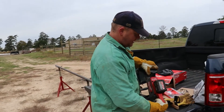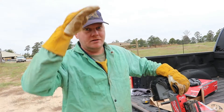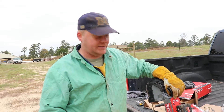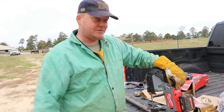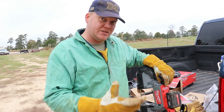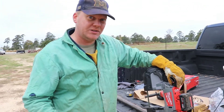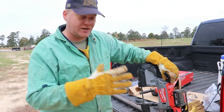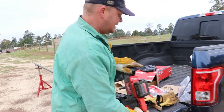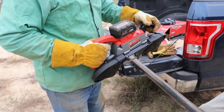All the tops of the pipes in the handling facility are varied sizes — they were crudely cut with a hot torch or something, they're all nasty. So I got myself one of these pipe cutters. This one's huge and the reason I got the big one was because these posts are three inches, not two inches. I wanted to make sure I had enough room to get in there and cut what I needed to. Like most things, you can't force it, but when it starts going it does its job.